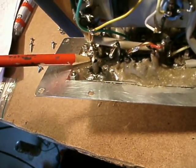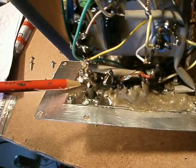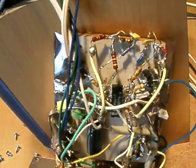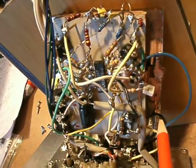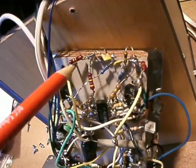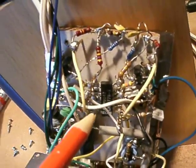You have a perfect earth plate — earth connection. You don't have to bother a lot about the principle of one-point earth, which is always necessary in audio amplifiers. Because this tin plate is your ground plate. So you can solder all the minus wiring, the earth wiring, to that tin plate. For the rest it's free building — free regarding the position of the components.